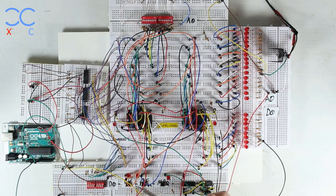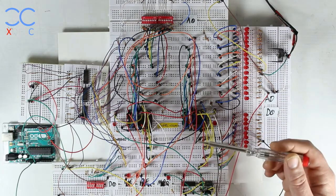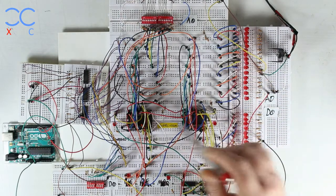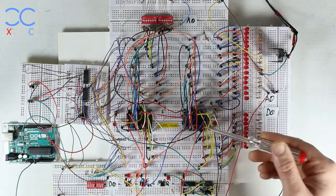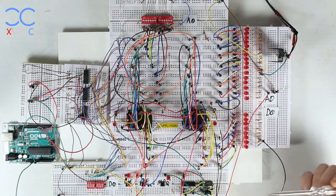Those three functions also represent what comes out of the CPU. The CPU has a memory request flag, a read, and a write. By working these, the CPU can either read a memory or write to it, or disable memory outputs when some other device is using the address bus, or enable outputs to fetch values into the CPU.